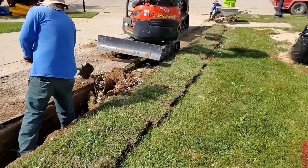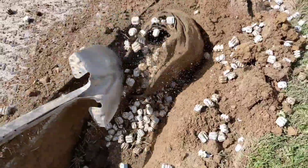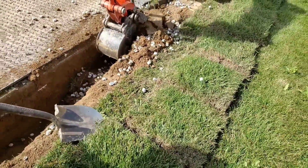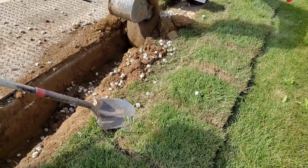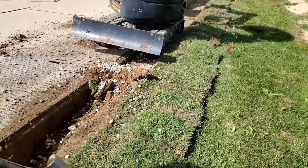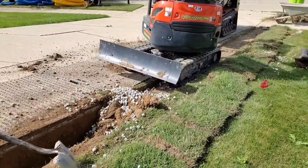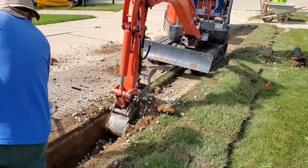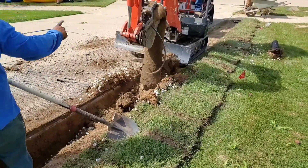That's what happened here. They put in the styrofoam french drain and catch basins, put the dirt on top, and of course cars are going to drive off the edge of the driveway as well. Once it's compacted and all those styrofoam poly rocks are compressed, there's no more void - unlike real stone where you can pile dirt on top in a nice burrito-wrapped, contained non-woven geotextile filter fabric. You can drive over that with a car and you're not going to compress real rock and lose your voids. Now, crushed stone will compress - that's the one negative to crushed stone.